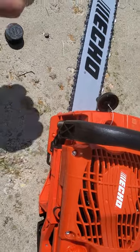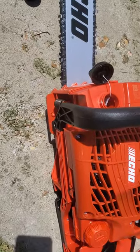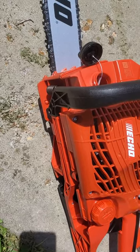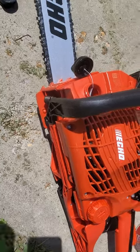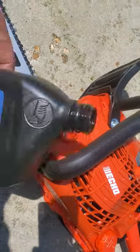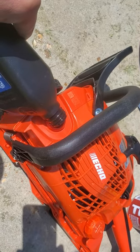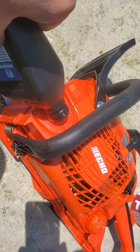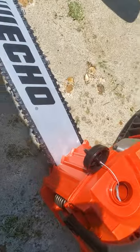There's a pump inside that pumps oil into the bar. For now I'll just put some 30-weight in there just to show you how to get it started — it's not going to damage it, and at least there will be some oil in it. But you definitely want to get the thicker bar oil. So here's where the bar oil goes — just put this right in here.